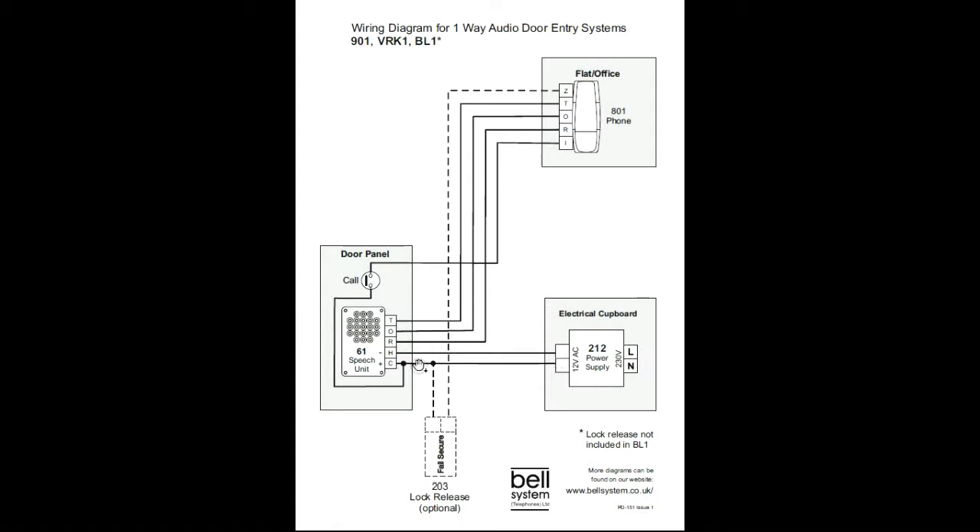Any of the brands we carry — they all in principle give the same output. On the intercom itself you have the generalized wiring, but they all have the same thing in common: an output for the lock release. Most of them apply a voltage, and as discussed in previous videos, when you press the lock button on your phone it sends negative to the lock release and engages it.